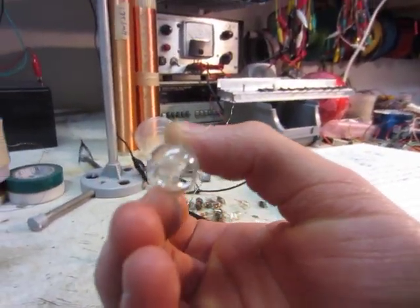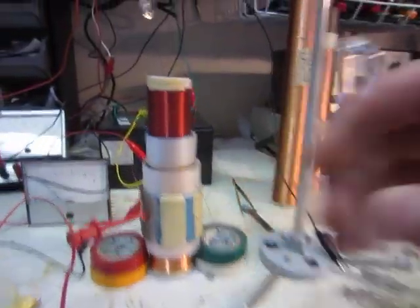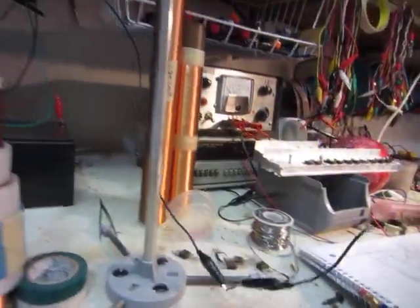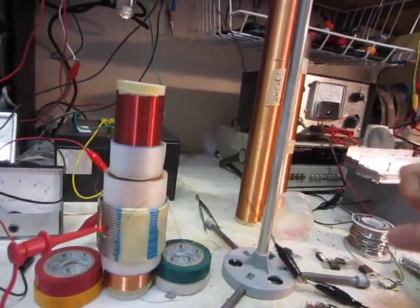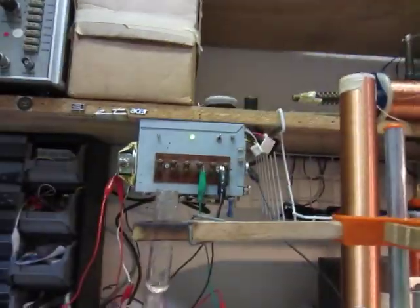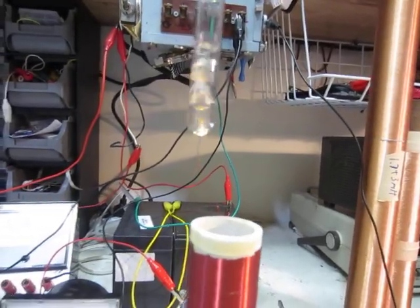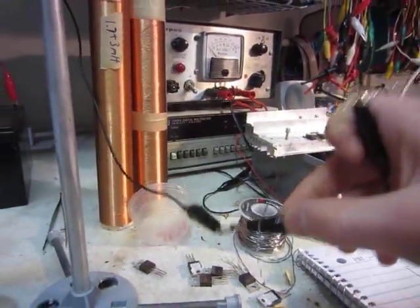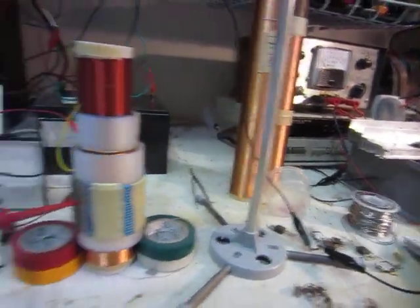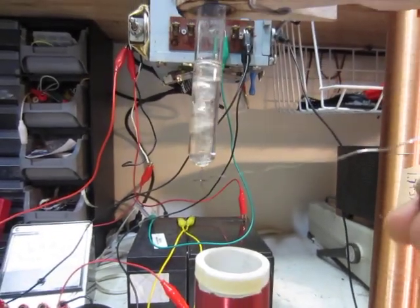The high voltage actually does fry the tubes a little bit — as you can see that one's kind of cracked up, and that one as well. One of the reasons my transistors burn out is that if I take this wire — which is grounded — and accidentally short it to the output, it will destroy the transistor pretty much instantly. So I put a 1k resistor in line with the ground lead, and that protects it from too much current going through the transistor.